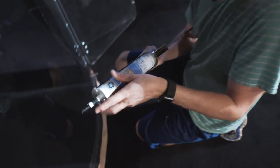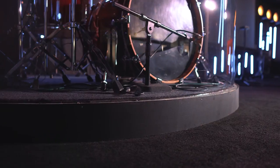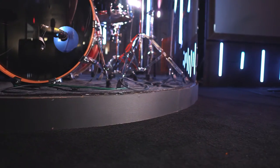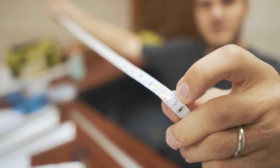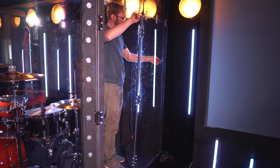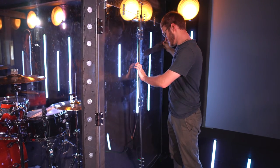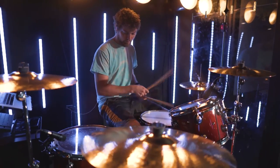We've got some black caulk that we're applying to the outside bottom. After caulking the top and bottom on both the outside and inside, we added the trim on the bottom edge of our platform and cut a small hole in the back wall to run some XLRs through. One last thing to touch on is our door system — because of the tight quarters, the accordion style worked out really well. While the door is still effective at containing the drum sound, it is not airtight and is louder to stand next to compared to standing out in front of the enclosure. This is something that could be improved on in the future, but we're more than happy with its performance for now. Let us know in the comments if you figure out a more effective door for your enclosure.